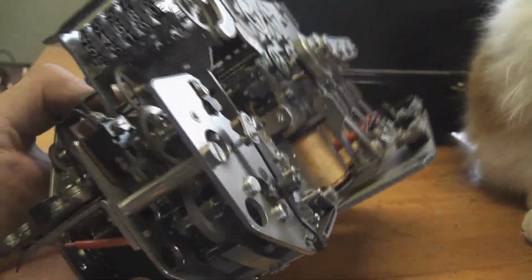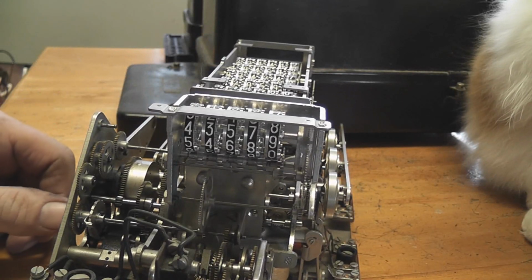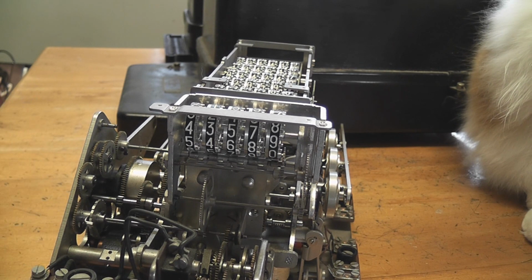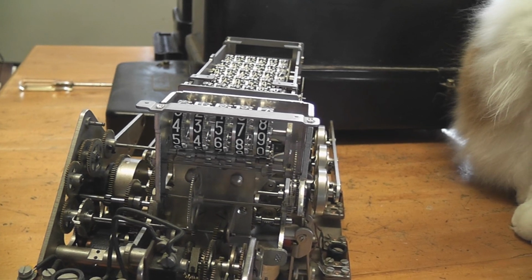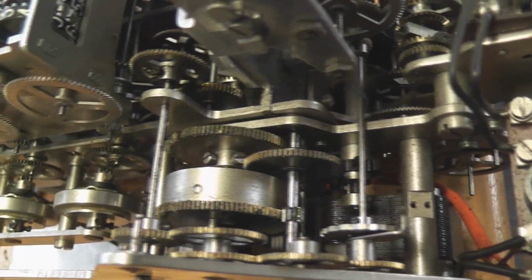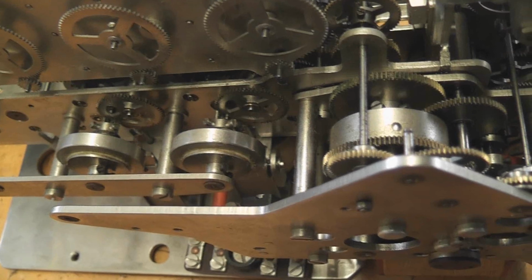The meters are designed to get multiple pulses at the same time from different sources like kVars and kilowatt hours and kVAs, and add them all up. And I think these meters even can subtract when you put appropriate gearing on them. Click all over the mechanism. These particular coils, they do work on DC.